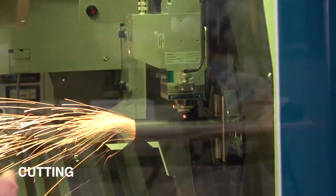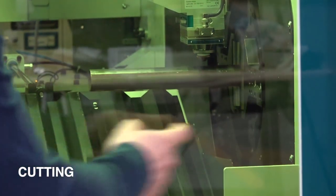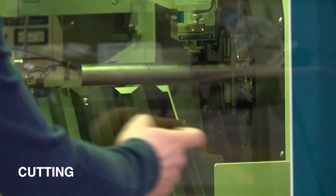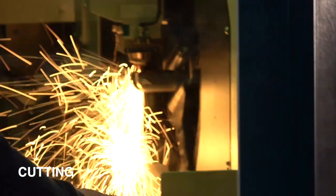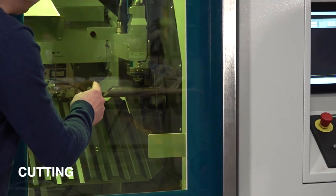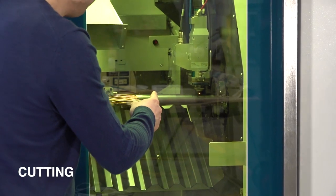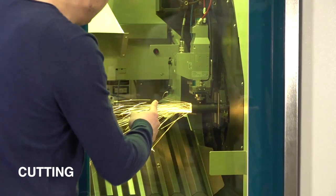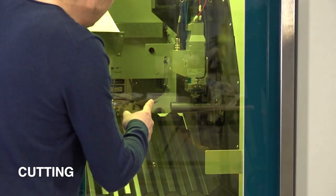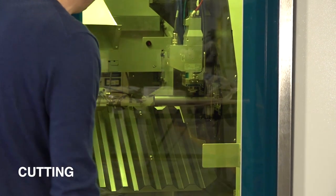You see, there is a pneumatic support. It is up to 80 centimeter, 800 millimeter length of the profile. It's an option that will be selected by the operator. So like this, 30 centimeter pieces, you can collect all the parts inside the scrap box, helped by this pneumatic support. But for more than 800 millimeter length, you don't need the system. The unloading system automatically comes inside the machine, and the cut parts drop down onto the scrap box again, helped by the unloading system.